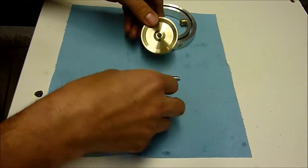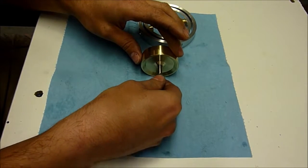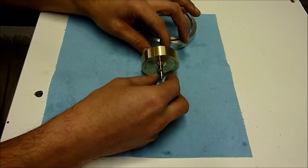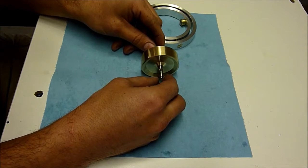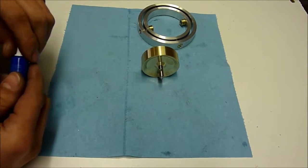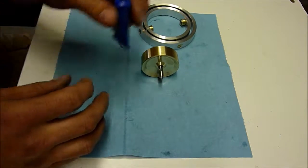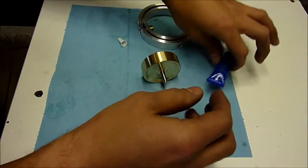And first we've got to put the rotor shaft on, so we're just going to use some retaining compound to do that. The axle is a really nice fit through there with that reamed hole. Fits great. It doesn't have to be perfectly in the center, because we can use our adjustment screws here to center it up, but it's going to be really close right there. So all we're going to do is take a little bit of retaining compound, and it kind of wicks into the tiny little gap between the rotor and the axle there. I'll put a little bit on here.